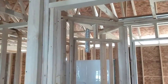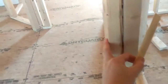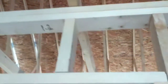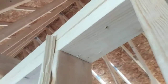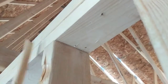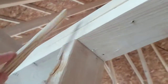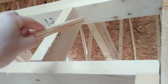The way that this is framed up, I'm betting the hinge is going to be on this side, which means the doorknob and strike is going to be over here. So if we look up here at the top plate, what we've got is a fairly good-sized gap. As the drywall is hung and not glued to the top plate, what we're going to get is air infiltration into this cavity here.